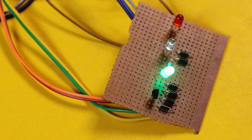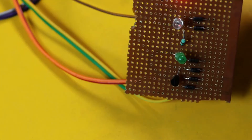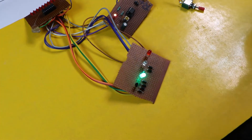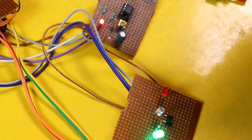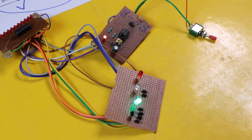The traffic lights cycle: red LED, then green LED, then amber (yellow) LED, and then red LED again — you can see it's working properly. You can also change the timing of the circuit. By rotating this variable resistor with a screwdriver, you can change the timing. Now you can see the pulse is very fast, and the timing changes — the traffic light signal is changing rapidly because the pulse rate is high on the 555 timer.